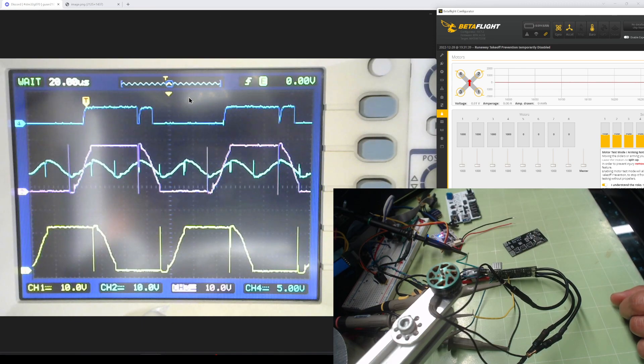On the screen, you're seeing two phases at 100% duty cycle — phase one and phase two. Overlaying the floating ground for reference, when we cross the floating ground — what is called the zero crossing — when the floating phase crosses ground either going up or coming down, this is the signal that tells me when a zero crossing event happens.